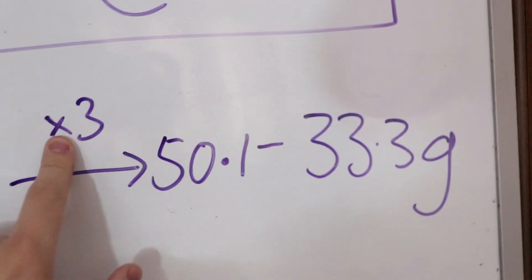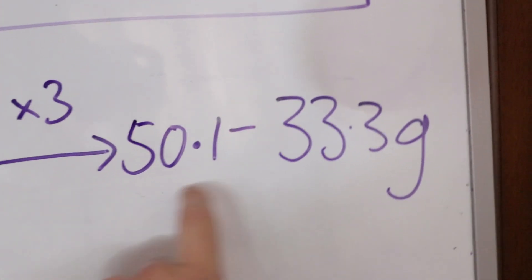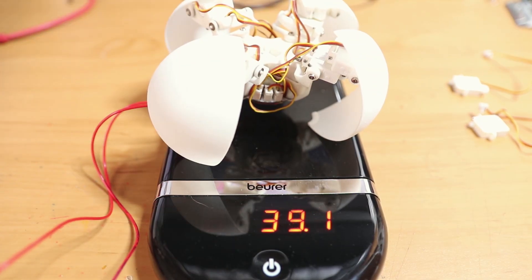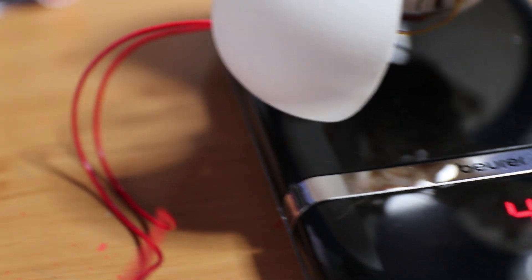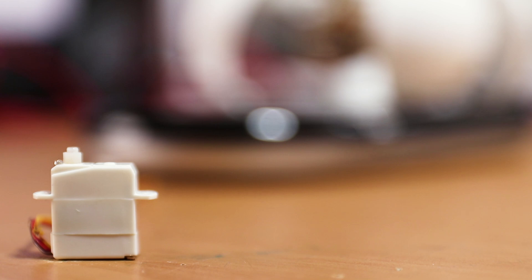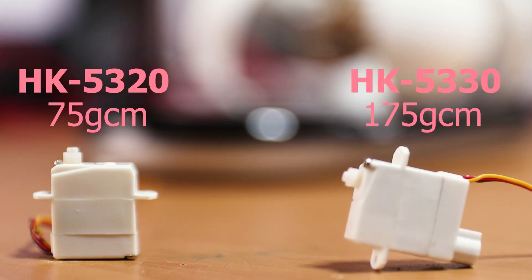This result means that in order for the robot to stand on three legs, it needs to weigh somewhere between 33 and 50 grams. So let's see how far off I am. The battery weighs 44 grams — that isn't too bad. It is a little risky because it's going to be at the exact limit, but just in case we have a problem, I also found a larger alternative which is supposed to have twice the torque. Let's start by testing the smaller one first.